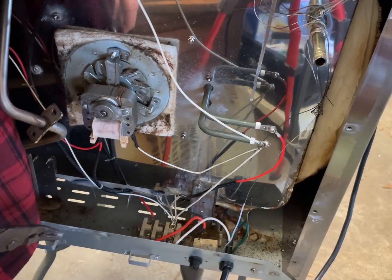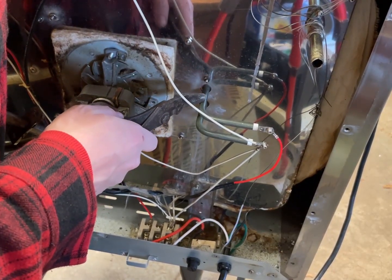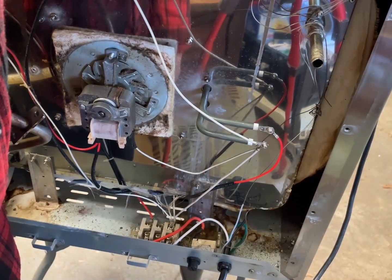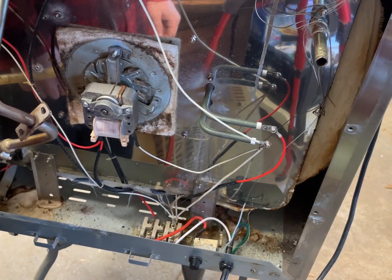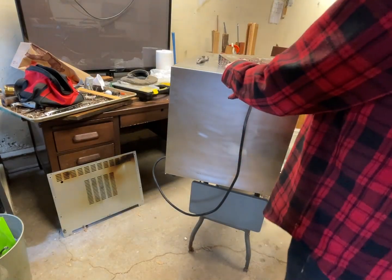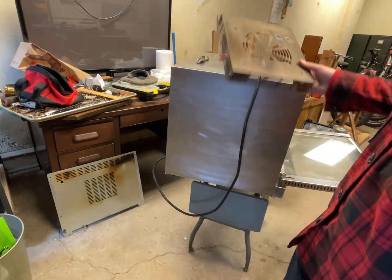Ah, they keep changing these things. So this should bend right here. This is at risk of touching the metal frame. It does have a gap of like 5 millimeters, but that's really close for 240 volts. Gosh. Now that we have the heating element in, the last thing to do is to clean up this and to clean that up.